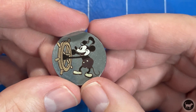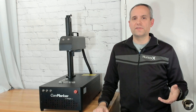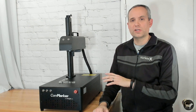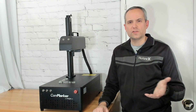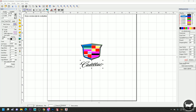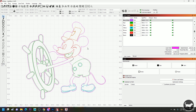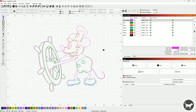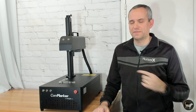The B4 can deliver accuracy down to 0.01 millimeters, so it's extremely fine detail. This is a fiber laser, so it works at different wavelengths than something like a diode or CO2 laser — it works at the 1064 nanometer wavelength, which makes it suitable for metals, plastic, stone, and leather, but not for things like paper and wood. The B4 can also be controlled through not only the provided EZCAD software, but also through Lightburn, where I did a majority of my testing. If you plan on using this with Lightburn, you will have to purchase the Galvo license.